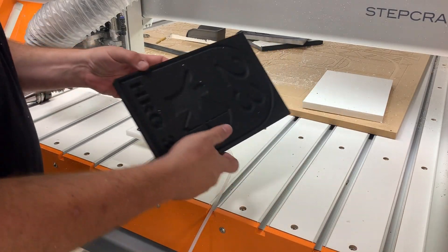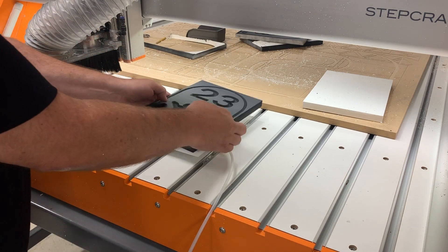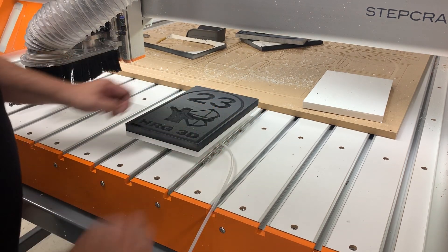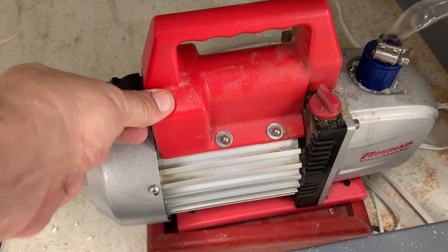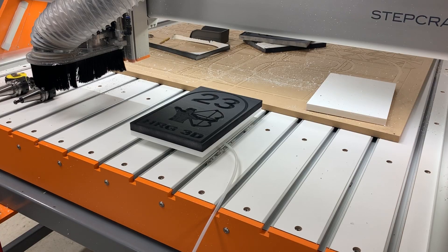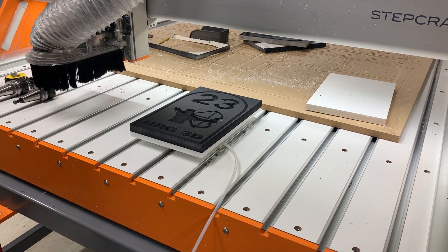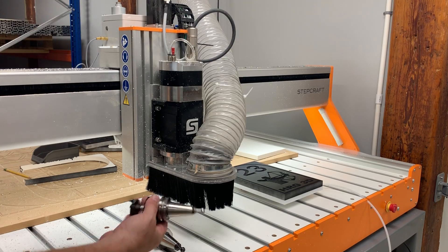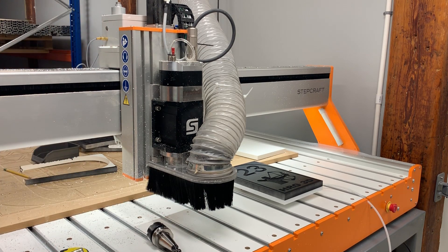The first thing I'm going to do is take my sign. I've got alignment pins in the back and my vacuum fixture has three matching alignment pins. I'm simply going to take the sign, line it up on the holes for the vacuum pins, then turn on my vacuum pump and push down on the piece to make sure it's secure. Now I'll put in my surfacing bit first — all I do is put the tool in the tool holder, press the button on the side of the machine, and the tool is secure.